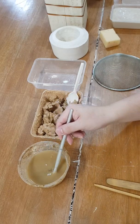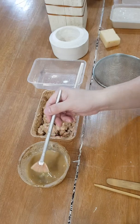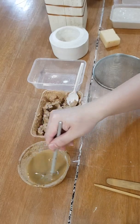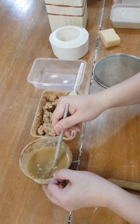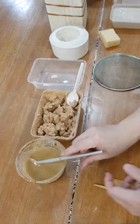If you just use regular clay and you slake it down with water until it's very liquidy, it wouldn't work for slip casting usually. It's just too much water for the plaster to absorb. So by the time it starts drying, it's already cracking and stuff like that. I'm going to try with that first.